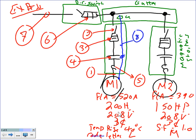So I have a magnetic starter here. Magnetic starter almost always indicates a contactor and an overload. If you make it a combo, they add a fuse and a disconnect to it. And last quarter, guys, we had one here. I think Gary's using it. You've seen it. We put it right here where you have an overcurrent protection device, a disconnect, and a contactor, and an overload. And out of this system, I'm feeding motor number 2.